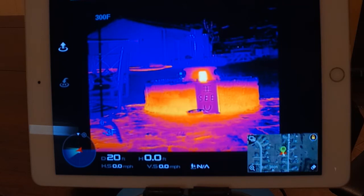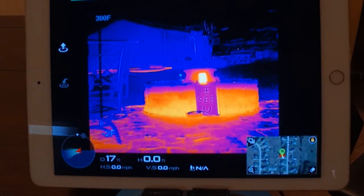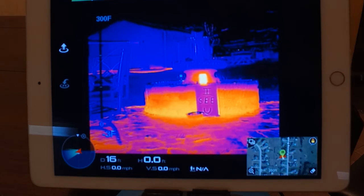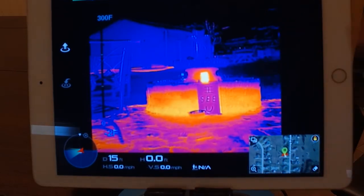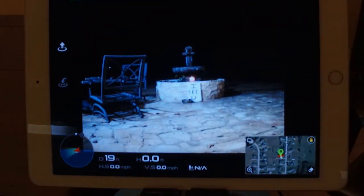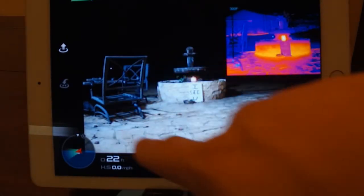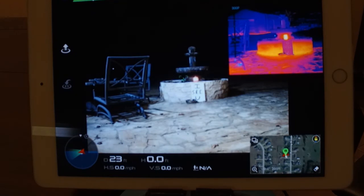All of this will come into play for a more advanced thermal unit and could offer a lot better results than what we're getting with the XT. The next thing everybody's curious about is what other modes are available. This image is being sent by the FLIR Duo Pro, so even on an Alta or another platform you'd see this same kind of image. We can switch over to the visible image — now we have a visible image from the Duo Pro. And then the last one, which is my favorite, is picture-in-picture: we have an optical image here and a clear thermal image right up there, and you can move it around.